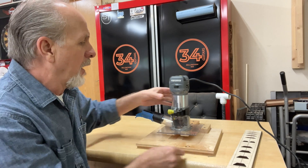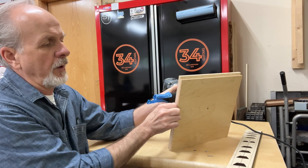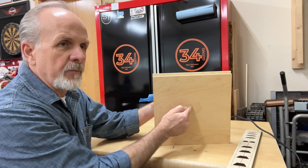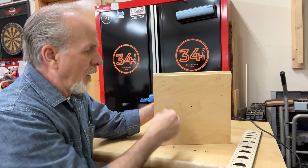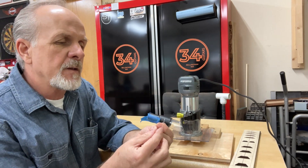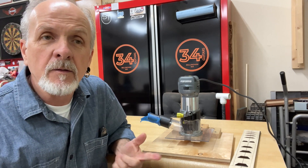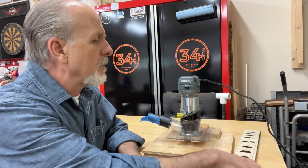The pin is basically just a little nail — probably three-quarter inch long. On the jig I drilled a slightly bigger hole about halfway through the three-quarter inch plywood so it would stick out enough. I drilled it big enough for the head to go through, tapped it in with a nail setter, and filled the back end with super glue so it doesn't back out. This pin is 1.5 millimeter diameter and the bit in there is also a 1.5 millimeter two-flute router bit, flat cut on the bottom.